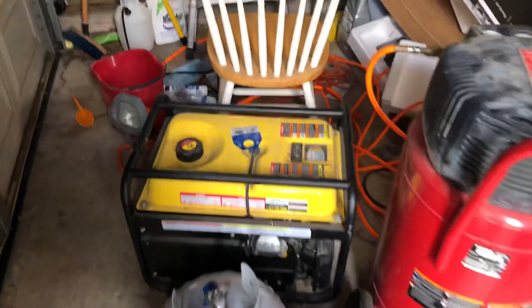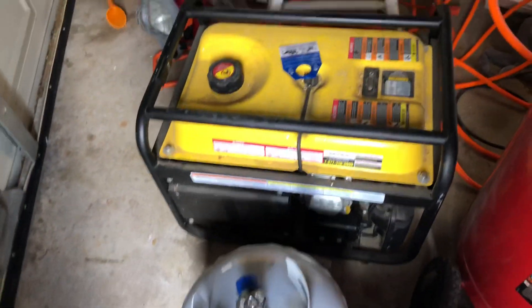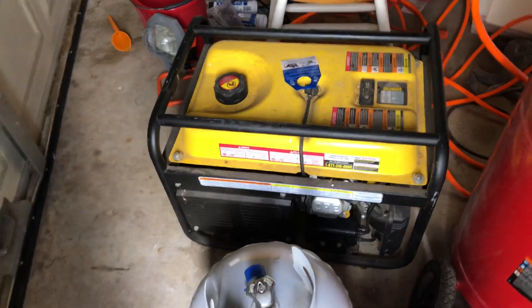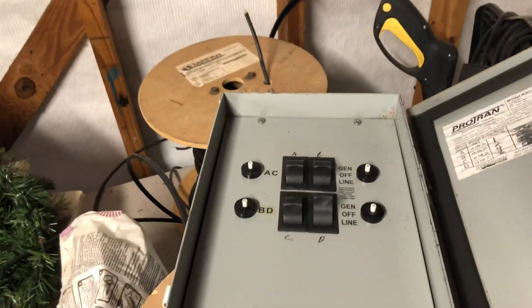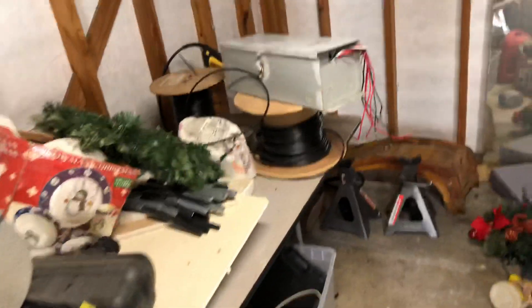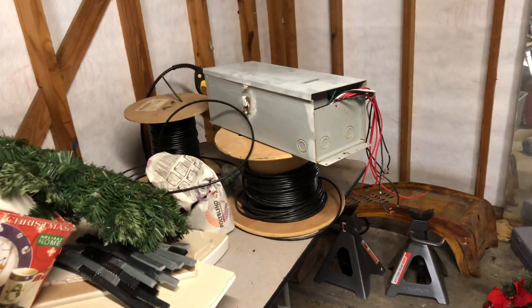A lot of videos show people who can't power their whole house, or who just use a smaller generator for a few circuits. The generator I had before was a Champion 4,000-watt, and I just had it set up for four circuits. I bought a transfer switch panel for that setup — it was about $200 — and the generator was around $500. It was fine, but I couldn't power my air conditioner.